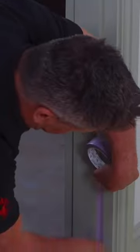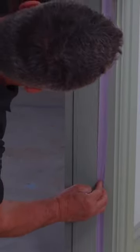Apply your masking tape tight up on the outside edge of the slab strip that's right in the middle of the door frame, then you can start to apply your paint. I'm using Frenchique's Victory Lane paint from the Alfresco range, straight out of the tin, and applying it with Frenchique's oval brush.